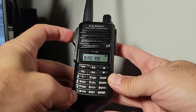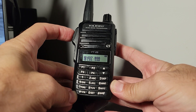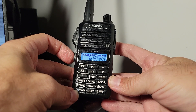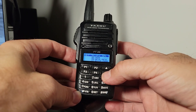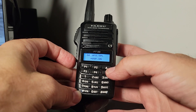The radio is currently generally configured to interact with the space station. However, if we push the push-to-talk — which we're doing for demonstration purposes — it's actually transmitting on 437.800, which is the receive frequency. That's not the result we want. There's another setting in the menu we have to configure: we go down to item number 34, which says VFO.SPL — that is VFO split. It is off by default, and we're going to turn that on.